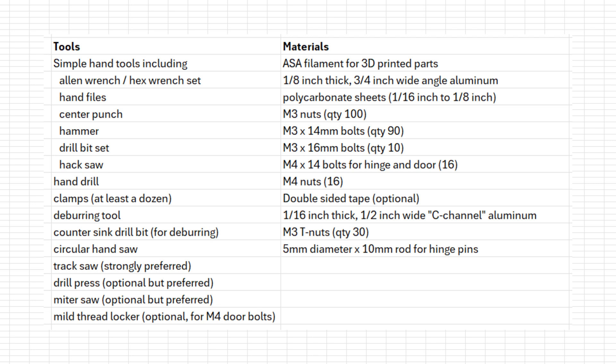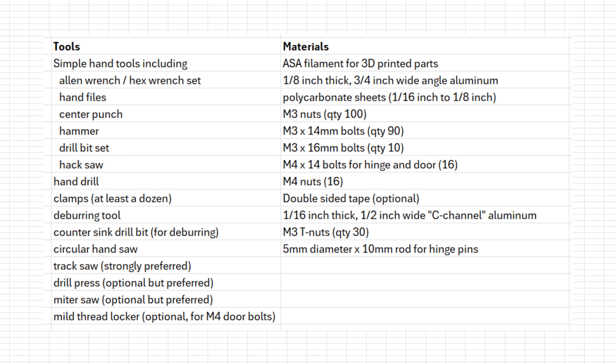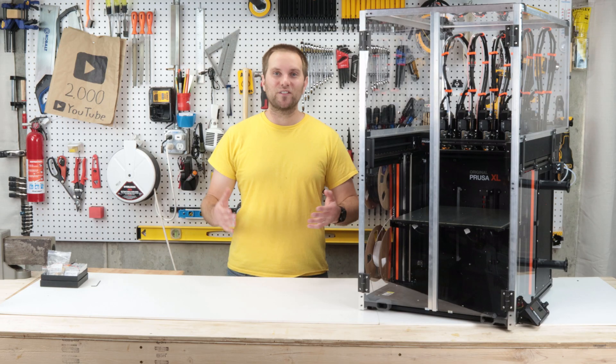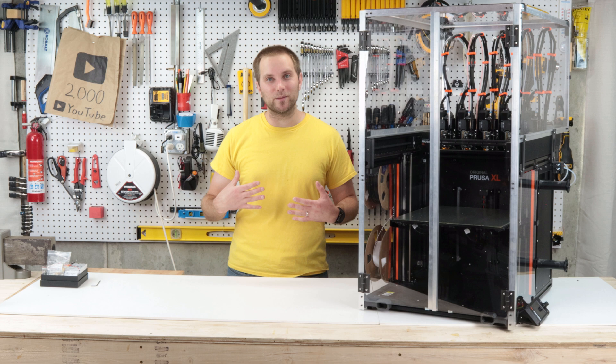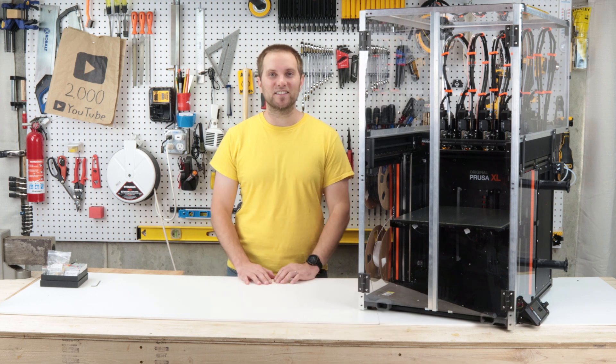The final topic is materials. All of the 3D printed parts I printed in ASA for robustness and good temperature resistance. The main structural material was eighth-inch thick angle aluminum, and the polycarbonate sheet was probably the highest cost. If you're going to do this project, I recommend going to an industrial supplier — in the US, examples like McMaster or Grainger would be much less costly than a home store. The rest of the materials you can get through an industrial supplier or something like Amazon or AliExpress. Well, that's all I've got for you today — thank you so much for watching. If you enjoyed this video, please consider liking it and subscribing for more content on building, making, and crafting. Thanks again, and I'll see you in the next video.